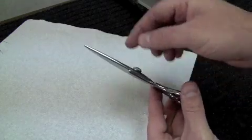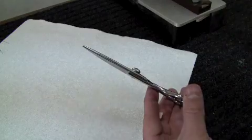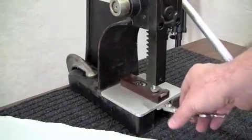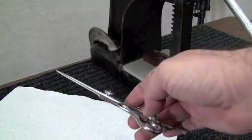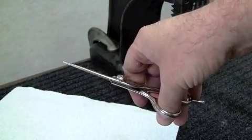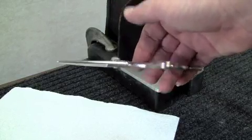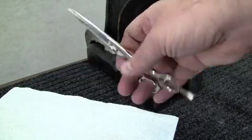This is a rather extensive view of how you can fix a severely damaged and bent shear. I tried hammering and that did not work. I knew that putting it on the Wolf set-adjusting tool was not going to be enough — in this case it was the one-ton press with the scissor bending attachment that Wolf makes that saved the day. The shear will still have to be sharpened before being handed back to the customer. Visually the set looked good, but we will see. When I do a post on this in the blog I will let you know whether the shear actually worked out. Just another way you can do some set repair, and hopefully a little bit of a help to you.